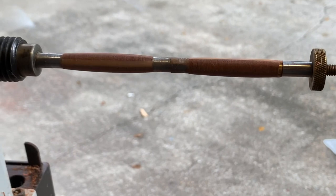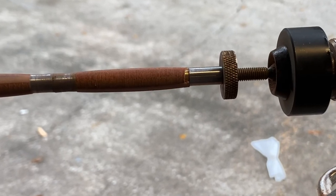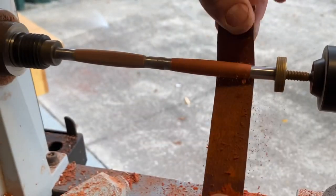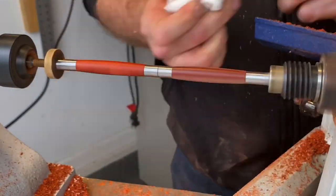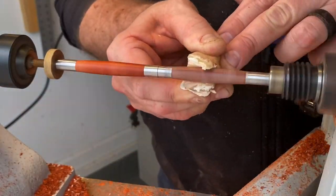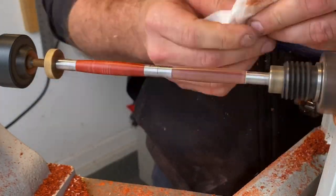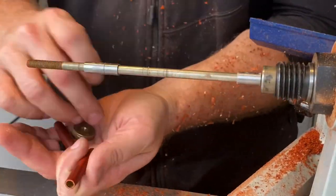As I'm doing this, a bit of an accident happened — I completely forgot that when you're turning resin on a lathe you've got to be careful of friction. I overheated the right-hand side pen blank, and it's completely my fault. So back to the drawing board — I've got a simple piece of wood and we're just going to make this mechanical pencil with one piece that has resin and one that doesn't. While turning resin, go slow in the sanding process, really eliminate that friction. Once I've sanded down to 400 grit, I take a little bit of beeswax, shove it in while it's spinning, then take a paper towel and use the friction heat — this time it's okay — and it gives a beautiful matte finish that's really nice to touch.